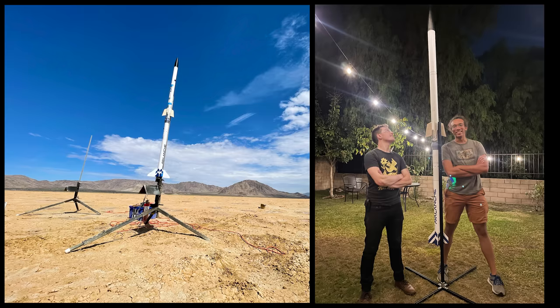I also drew up a new ground control interface in Processing. A few things I've learned through flying lots of rockets in the desert: you want an interface with a white background and black text — it's a lot easier to see on a dim laptop screen in the sun. You also don't care about almost all of your telemetry when the rocket is flying. There's stuff you care about on the pad like continuity and vehicle state, but when it's flying you really just want altitude, speed, and GPS latitude and longitude. So the goal with this new ground station is to keep it dead simple, with the key numbers displayed really big.